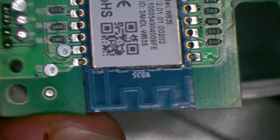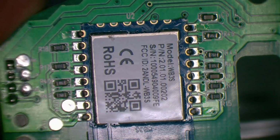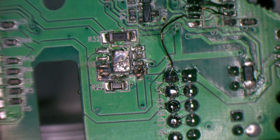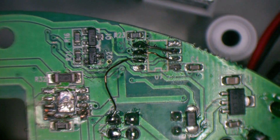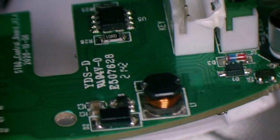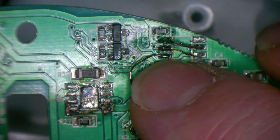Guess what I found? This Wi-Fi module, this thing that I thought was just a Wi-Fi module, is actually the processor that controls everything. I thought something I should have checked before is, here's the key button, because we've got ground, this goes up to the button on the side, and I thought, well, where does the key pin actually go? I made a stupid assumption that the chip up here is a little microcontroller, and was doing the guts of the business because, with probably good reason, the 3 pins up the side here go to the motor control, so motor on, and the laser on, and that's actually laser voltage supply.